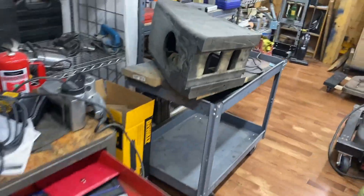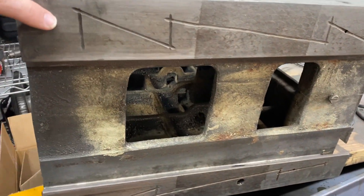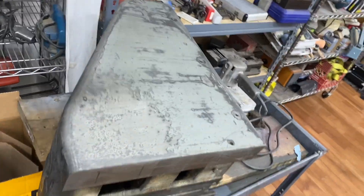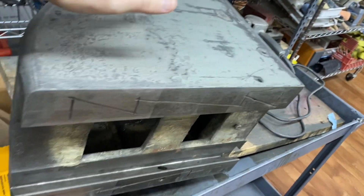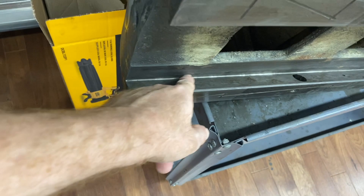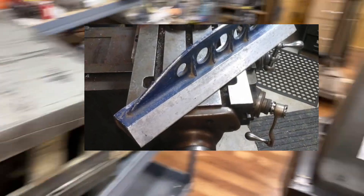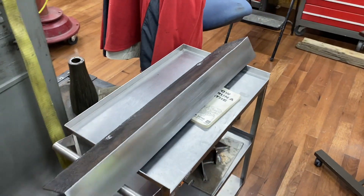Furthermore, when I go to do this part here, I could theoretically lift this up onto a surface plate, but think about how heavy that's going to be. So it's maybe better to put your reference surface there than putting this on the reference surface. And if you're going to get into there, how are you going to do that? That's kind of where a machinist straight edge can come in. Here's the one that I've made, and we're going to talk about doing that today.